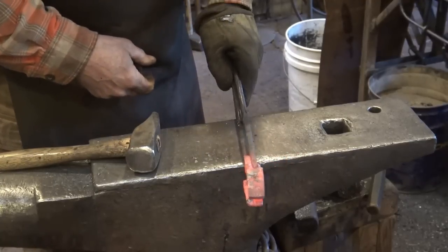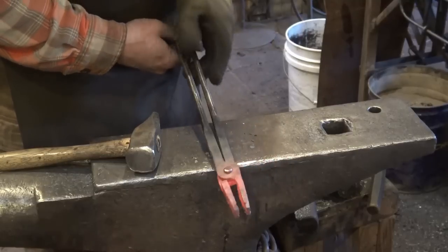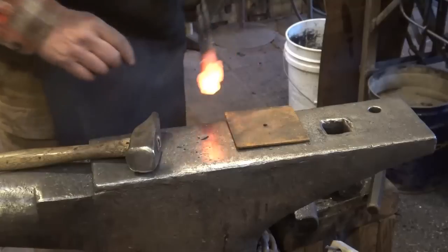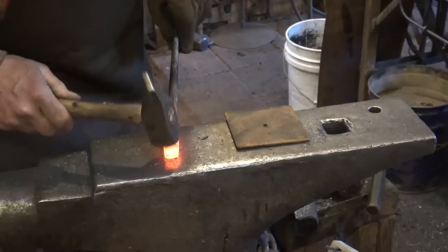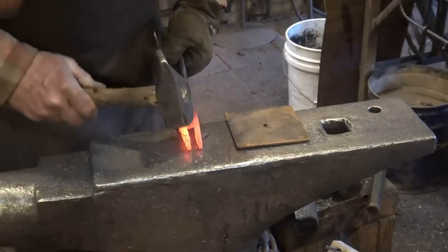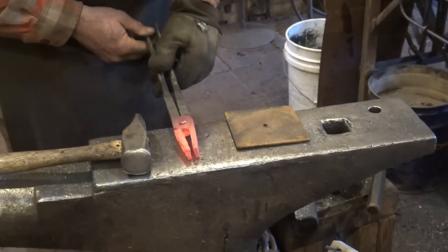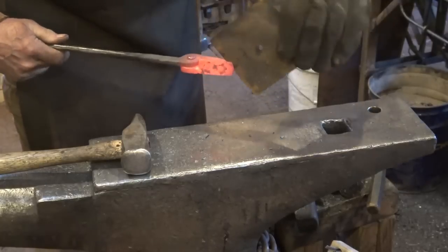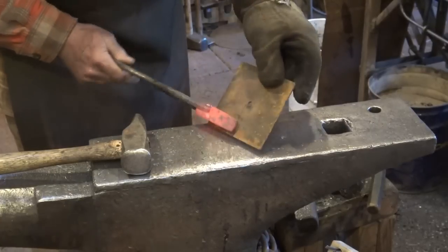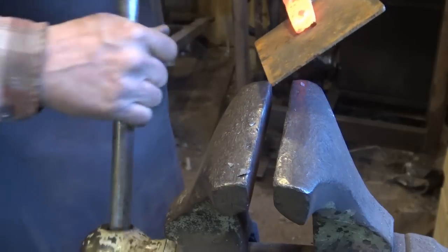While they're hot, you can work them. If they completely seize up at this point, just put them back in the fire, bring it up to heat, and work them just a little bit until they start to open up more. Now we're going to have to correct the jaws — there are a few misalignments. We want to make sure we keep that groove lined up; if everything else doesn't line up with the groove, we'll have to make adjustments elsewhere. I'm more worried about the groove. I'm going to make these hold 1-1/8 inch stock, so I'm going to have to squeeze those together, and I think that is easiest done in the vise.